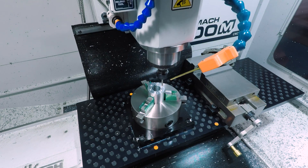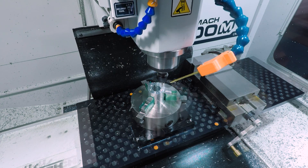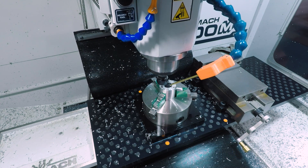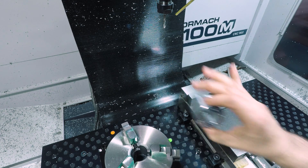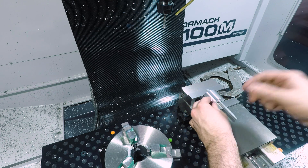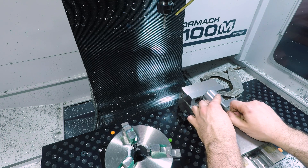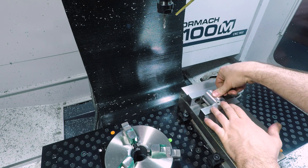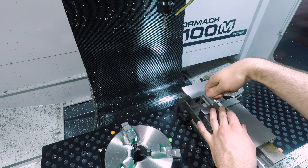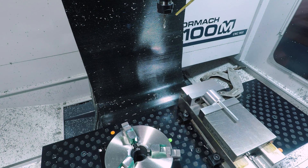Just drilling a bolt circle for the wheel discs in this op, then moving the part over to a vise so we can drill the holes for the grub screws that will secure this hub to the axle. Using a little trick — taking a spare piece of keyway stock and letting the part dangle on that while we snug up the vise, in order to really easily be sure that we are drilling perpendicular to the top of the keyway.